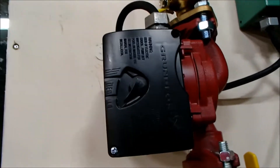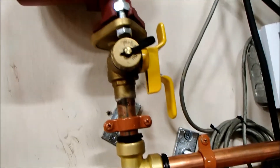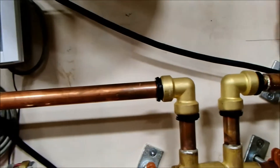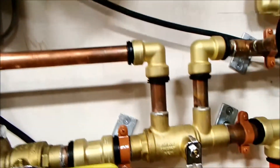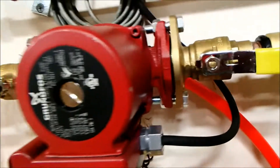You should really size your pumps based on the amount of loops you have on your floor. These particular pumps have a head range of 0 to 29 feet. After that we have another isolator service valve — this is actually where you would introduce fluid into your system, and the one at the top is where you would remove fluid or air as you're doing your filling. This goes down into the 3/4-inch to 1-inch purge T, which is your mixing valve that mixes the primary and secondary loops. We're now switching over to one inch, and there's an isolator ball valve before the secondary pump.